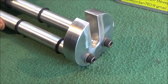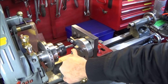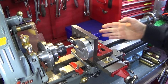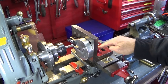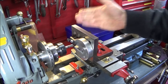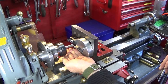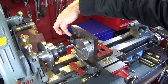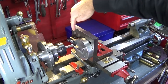The hardest part to make is obviously the front end with the slot in it. I did this on the Myford lathe and I'll show you the setup and how I machine that now. This is the actual setup I used to mill the slot on this component. I'm using a right-angled cast iron fixture plate — heavy duty, with five slots on either side — to bolt it to the Myford ML7 cross slide with T-nuts. I've put an Allen bolt through one of the existing holes on the component and a clamp at the back, done up nice and tight, positioned square, and moved it to allow for the actual depth of cut. I've zeroed it on my saddle stop on the front face, then moved back on the adjustment by about 10 thou so it clears this face by 10 thou.